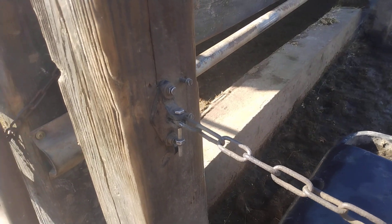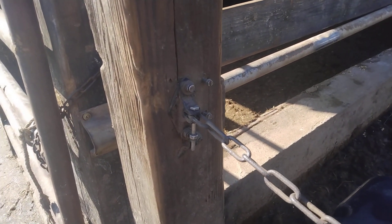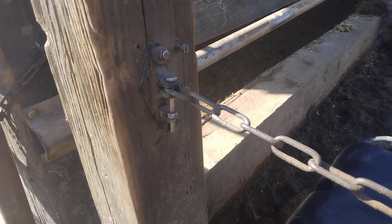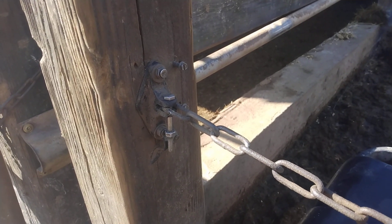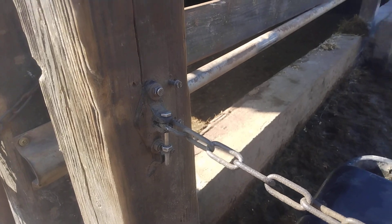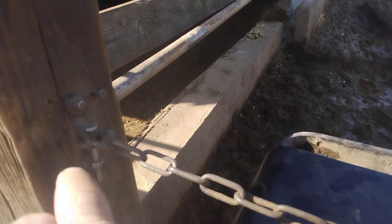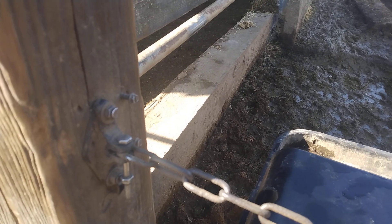On the ends of my post, at least for this gate here, I use these little black insulators. Then I drop a grade five bolt through the link. When this gate gets looser, I can shorten the fence up one link at a time just by adjusting the bolt.